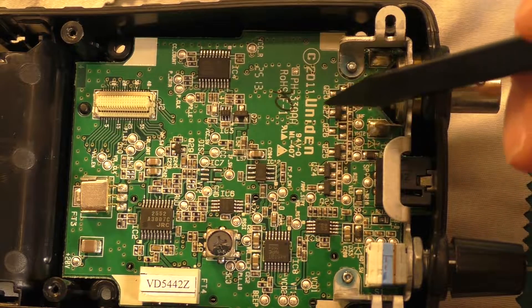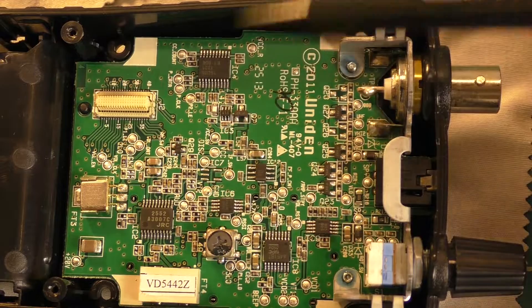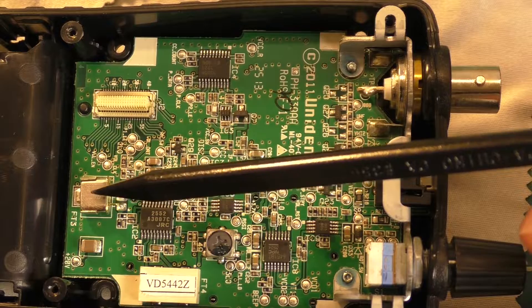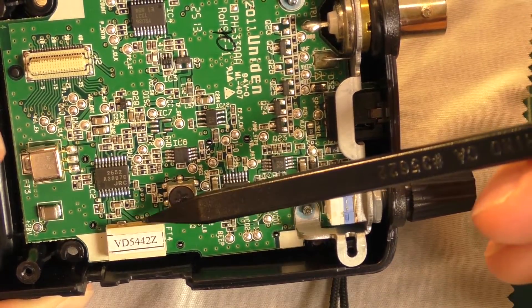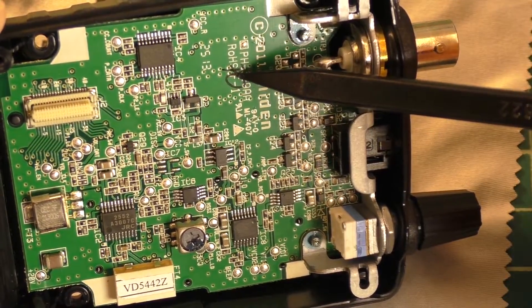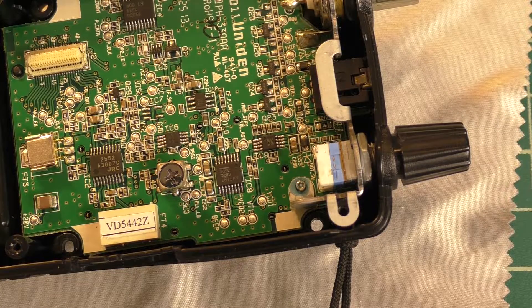In this area I'm assuming we have some sort of RF preamp type stuff, and there's a trimmer here which I'm assuming is a variable inductor. The crystal oscillator over here is apparently 21.3 megahertz, which seems like a kind of odd value. I'll also note that this board has 'OK' written on it, which apparently means it's been tested. I'm going to go ahead and try to reassemble this thing and see if it still works.